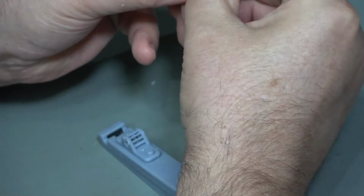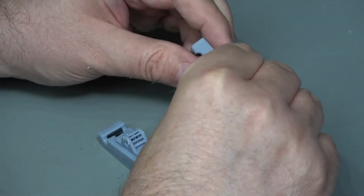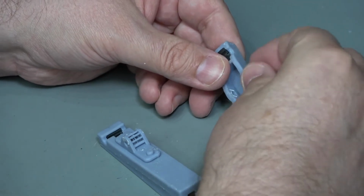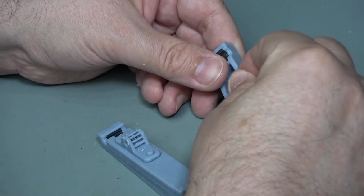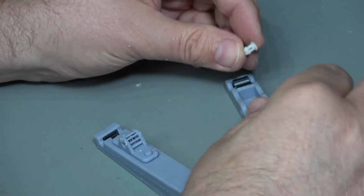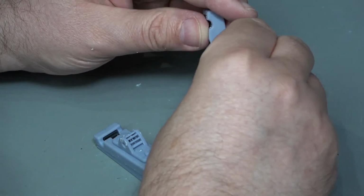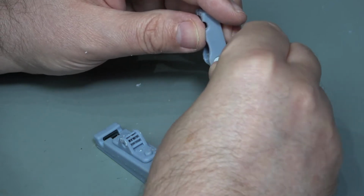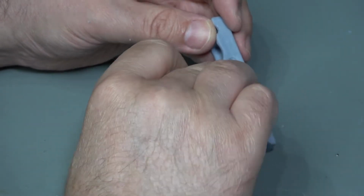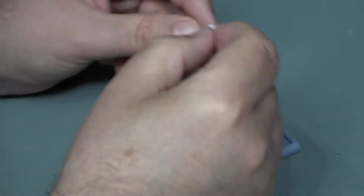Now the other thing I'm pretty sure I have problems with is these pins. These are intended to go through this hole and kind of latch it in place. Now they should be the right length now. I should be able to get them in from opposite sides, because I had actually manufactured them slightly too long on the previous iteration. But I think they've still got a problem, which is that they don't actually snuggle into the hole. There's a recess here, which is about half a millimeter deep, and the head of this is actually supposed to go into that, and it's not doing so.